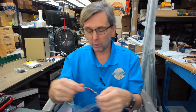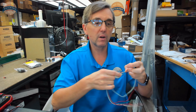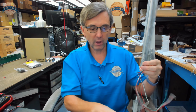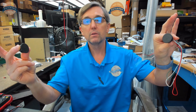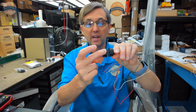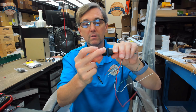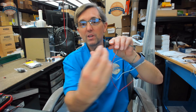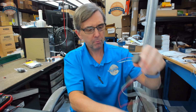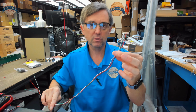So what the client needs is either the opposite version of his Hafele door position switch, the opposite electrical configuration, so that when the contacts are separated, the circuit is closed. And when the contacts are brought together, the circuit is open. So he obviously has circuit closed here and circuit open when he opens. So when he opens the door, the lights turn off, is what it is. So you could go with a single pole, double throw switch like this is the other option.